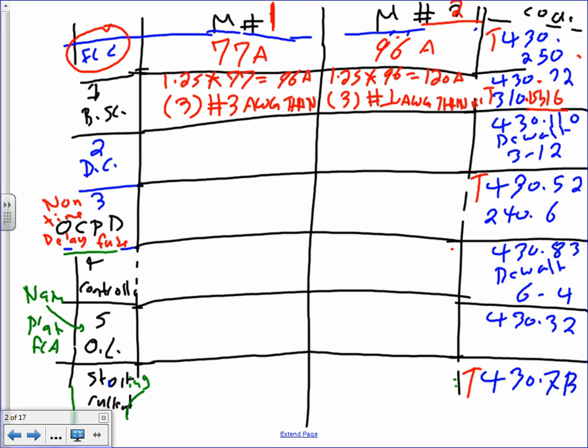Now, moving on, and you work for a company. When you go size a conduit, you see a number 3, well, how many number 3s are you going to put in this conduit? The number of the conductors becomes as important as the conductor size. I want you to get into the habit, when you throw a feeder, you're going to throw how many conductors, what size, and what insulation? Very, very important. Okay, disconnect. Any question that's straightforward? I think it's straightforward, right?